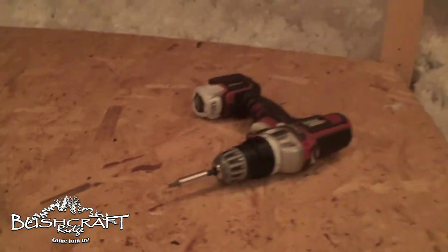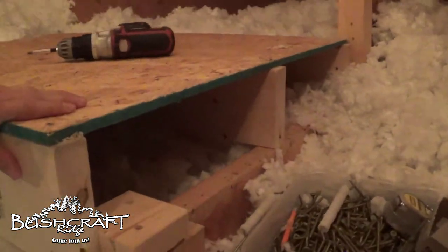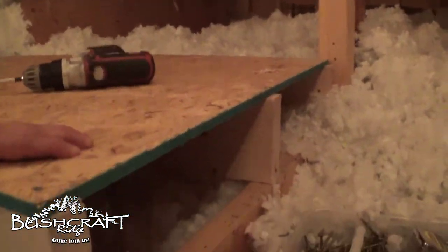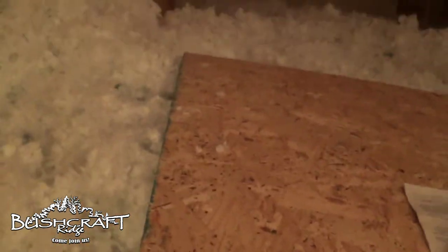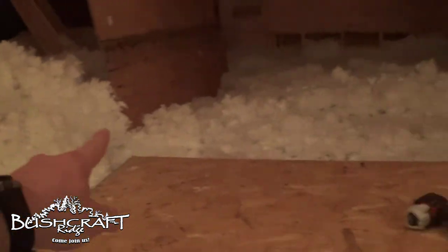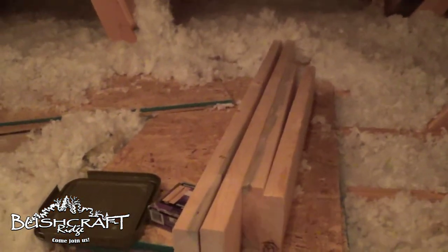The only reason we're not putting the platform directly on the joists is so we can stack the insulation and meet code. So far we've gotten this four-by-three-foot platform in — I didn't quite get it square because a joist was in the way, but it's very close. You can see the two-by-six risers come all the way through and sit on the joist underneath. It's sturdy — I've walked on it, stood on it, jumped on it. This is just that OSB board ripped down into two-by-three-foot squares.